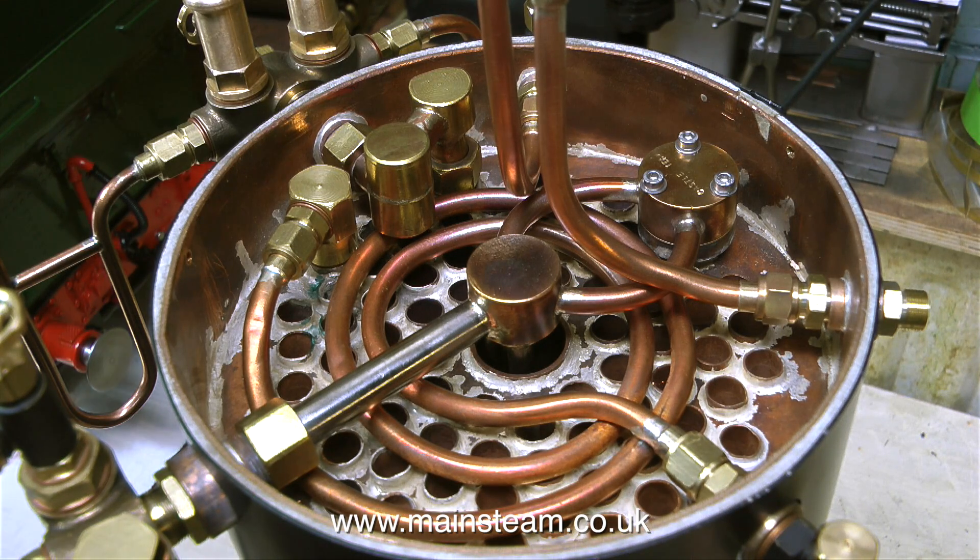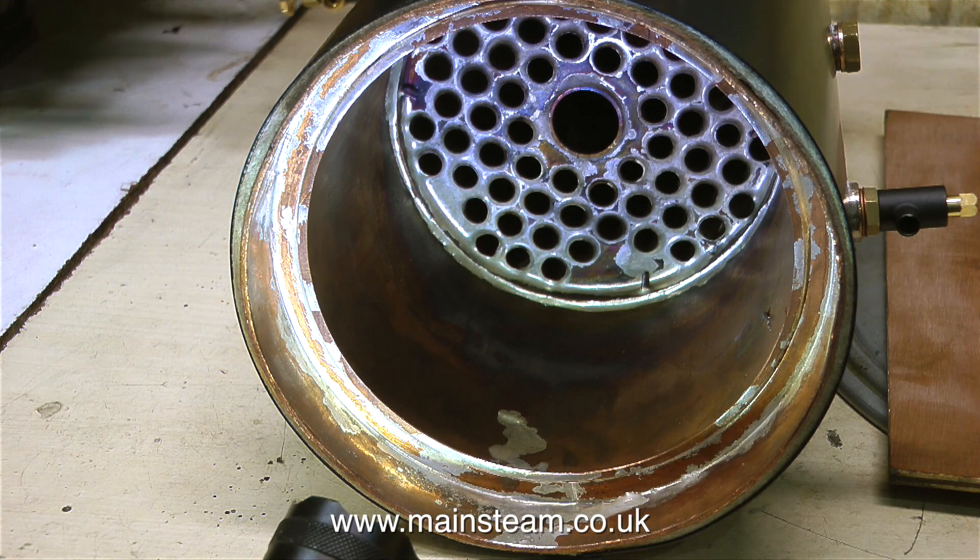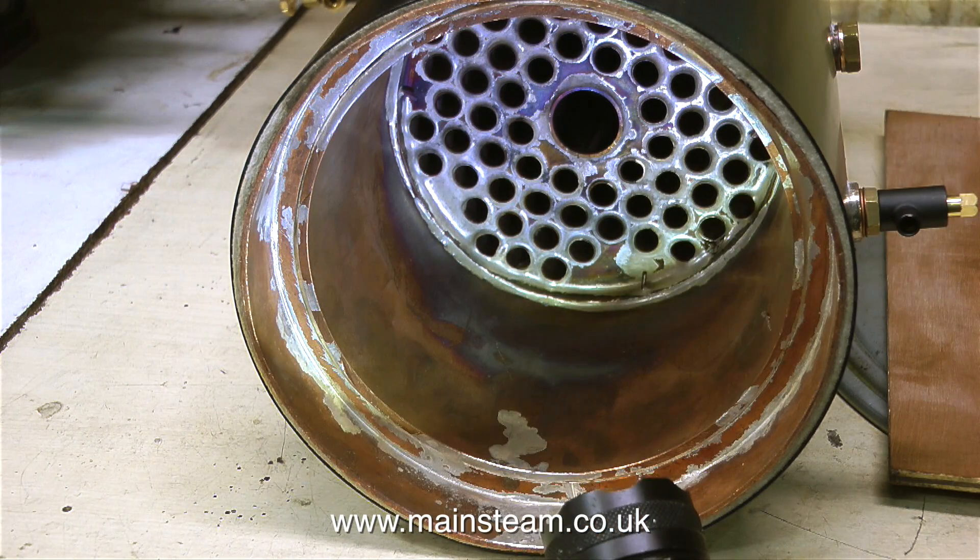The wet header is the part that takes the steam from the boiler and feeds it to the superheater — in this case it's the fitting to the right of the picture with three bolts in it. The coil at the top of the boiler is not a steam drier; this is a water feed preheater. A really well thought out design feature of the V6 boiler is the feed water delivery arrangement. The preheater feed goes all the way down through the boiler and delivers the water to the top of the firebox where it's really hot. As this water is warm to start with because of the coil over the top of the fire tubes, it shouldn't drop the pressure much at all.